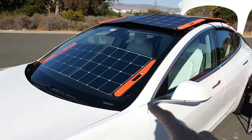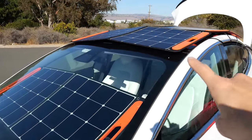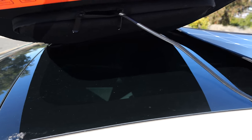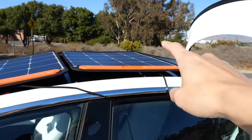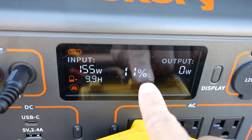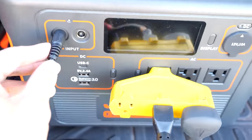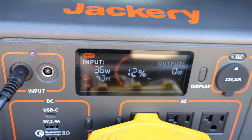Now if you're parking this thing you obviously want your solar panels inside so no one can steal them. If you put them on top, maybe someone can just clip off the wires. But I can't put these underneath anyway because the top of the Tesla is dark over here and over here, and it's too small towards the back. So I have to put three of these panels — 100 watts each — on top. I'm getting 155 watts charging in. It's around 4 p.m. so the sun is not as strong. With only the one behind the windshield I got 36 watts, but it can go up to like 80 or 90 with really strong sun.